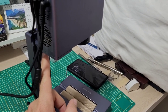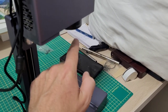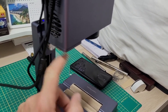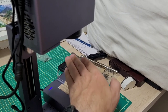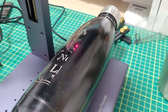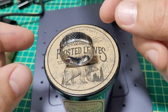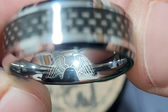One cool feature is you can rotate the laser head. If you're engraving on the roller and the tumbler is quite high, you loosen this knob, tilt the head back, push it out further, and now you can get that required 130-millimeter focal distance. I grabbed an old water bottle and gave it a quick engraving. Then I had a spare wedding band I didn't like much, so I engraved the inside — I put a little pair of wings. Look how clean that is.